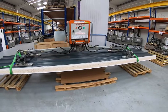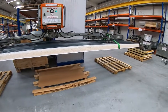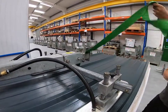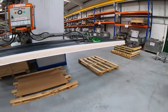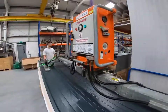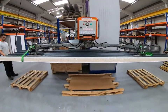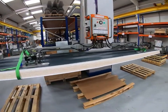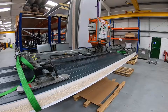When you receive the panel on the roof and you come within a few inches of the purlins, stop manoeuvring. Release the safety straps by pulling the pin, and pull the strap away from the panel joint so it's not fouling anything. Then continue to position the panel. When it's in position and you're happy with it and have a fixing in, you can release suction — as shown — by pulling the pin and operating the lever into the red zone. So that's a quick introduction to lifting a roof panel with a standard roof configuration. The machine is fairly easy to operate. We'll drop it back into the cradle now and I'll talk about a few other features of the machine in a separate video.